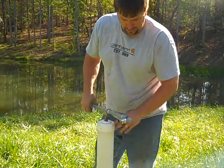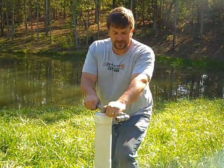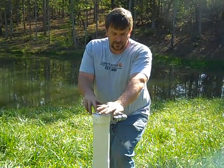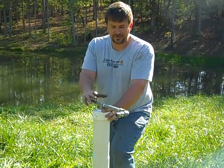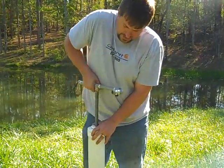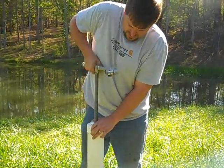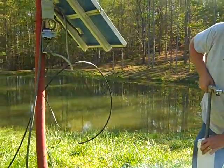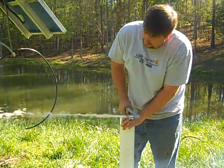Build your own pump — very simple galvanized fittings. If you don't like galvanized because you taste a little metal if it sits for a while, you can do this all out of PVC. You don't have to use galvanized; you can do a PVC T-handle. I just knew this wasn't going to break, so I can push and pull as hard as I want and it just pumps. I'm shooting water about 30 feet, so it'll out-pump that pitcher pump you buy at Lowe's.